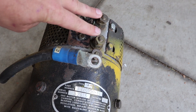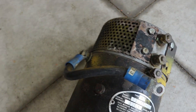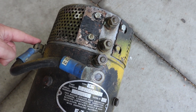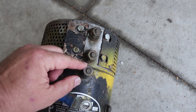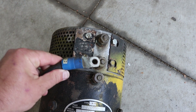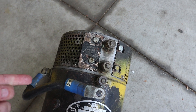You'll see it's got four power connections — two here, one here, and one over here. The way a series wound motor works is power comes in on one end, it goes out the other end, and in the middle you typically have some connections that are either jumpered or have a bus bar. But depending on if we went here or here determines which direction it spins.